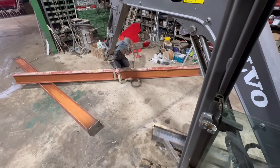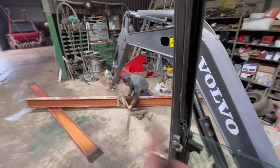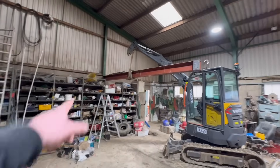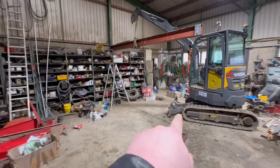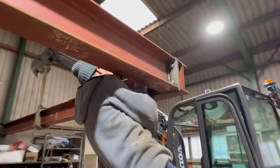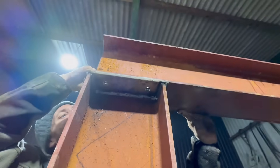The first bit is welded — well, all these bits are welded. We're going to lift this bit up there with a digger, then the next bit we'll lift up there with the JCB, and then put the steel post from the floor up. The bits are going in from there to there, and look at this — it's like it's made to fit. The post got a bit dirty on the floor. I'm going to drill these out and put some ground anchor bolts in. It's still steaming where it's been welded up.